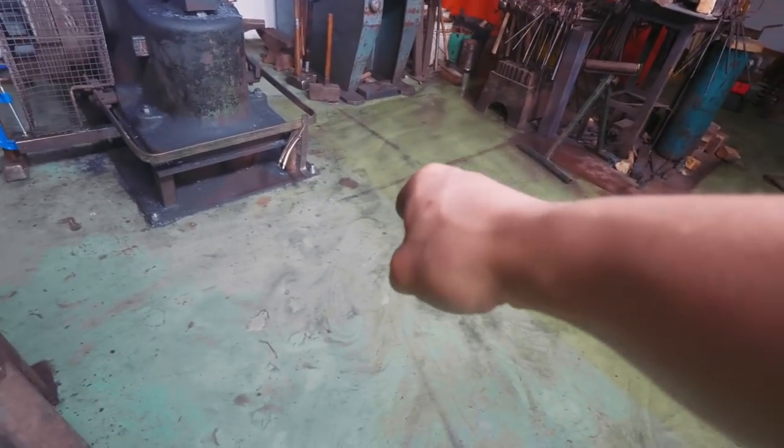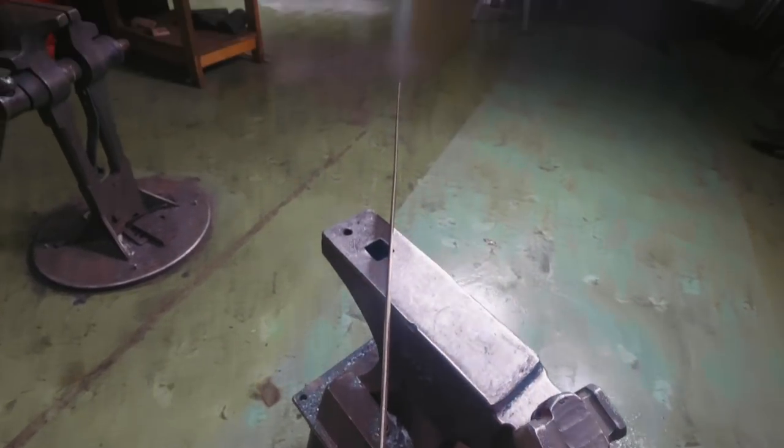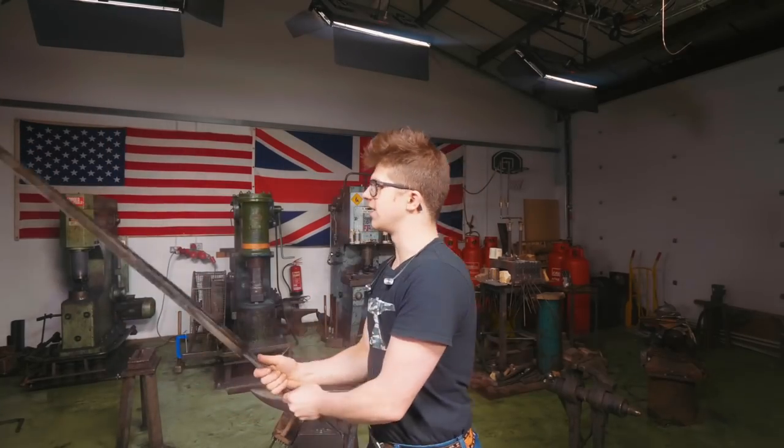I ended up mopping the whole area. It's cooled down now — it's got a nice even straw the whole way along, and I tempered back the tang transition to a nice blue-purple, which gives it good flexibility. The blade still has a slight wiggle especially in the edge, but with the edge still about an eighth of an inch thick I'm hoping we can grind most of it out. Very excited to keep working on this tomorrow — finish grinding is gonna be exciting. Christmas is less than a month away, which means I can soon start singing Christmas songs!